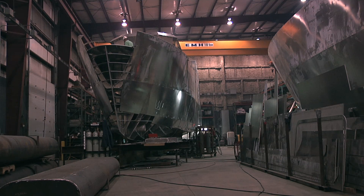In order to build these vessels, we have engineers on site. We start with a concept design. From that concept, we do some detailed drawings, loft all the material parts, get it cut, etched, labeled. So when we bring it into our facility, it's a big jigsaw puzzle. So all our welders put it all together.